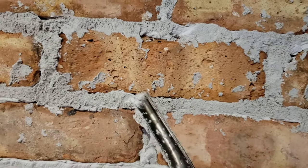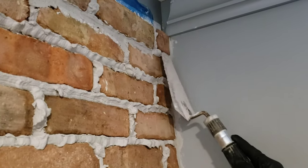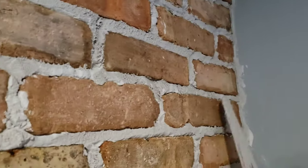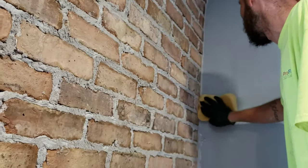When you fill them all up they look like that; when you don't fill them all up they look like that. When you use the sponge the gaps will get filled, but it's better to fill it all the way. The margin trowel is the best way for this — you just use the flat side of it. You scrape it all up, and as soon as you're done scraping it all up you hit it with the sponge. Looks good, then you clean it with the sponge.